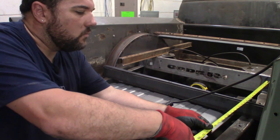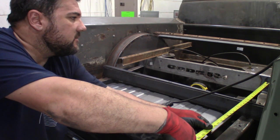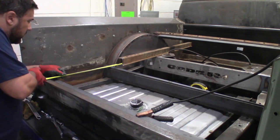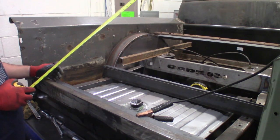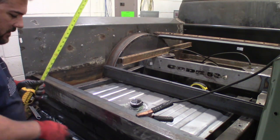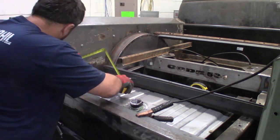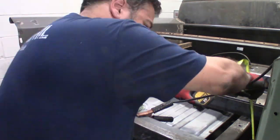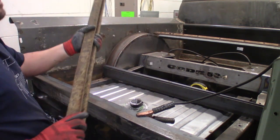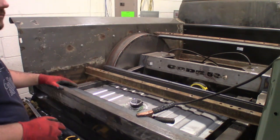Half of 29 is 14 and a half — that's where we're going to center this cross member. I need to measure 14 and a half inches. It works dead on square right there — that'd be a decent sized bed. So 14 and a half inches is what we need to measure from here over. Now this is going to go something like this, so let's get that tacked in. That looks really good right where I have it — fire up the welder.